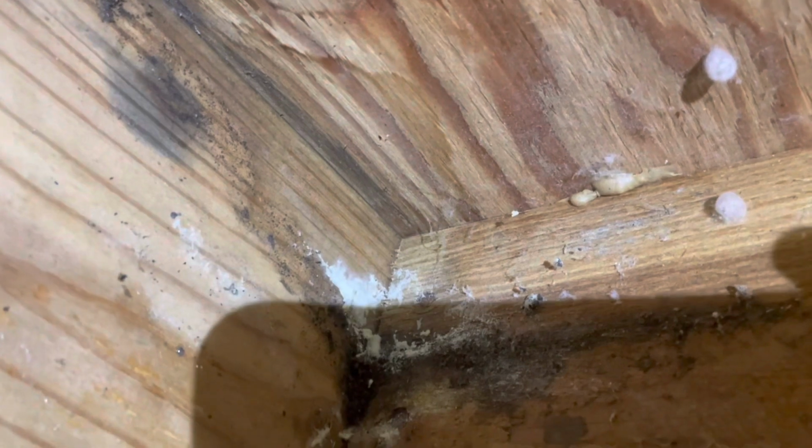This is the very end of the joist, just one joist. You can see it's got a little bit of rot there on the very end. It's not terrible. We can fix this one pretty easily because it's not much rot. Maybe cut a joist that's about 3 or 4 feet long and just lay it in beside of there. So that's no big deal. The floor does not look rotten. That's excellent. I'm going to move my way down a little bit.